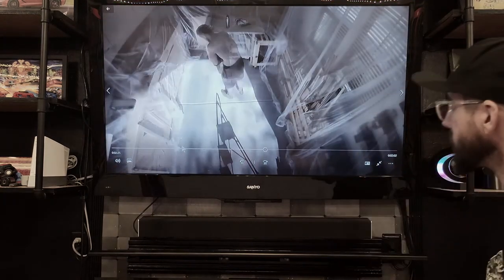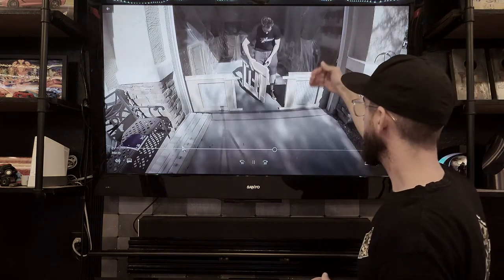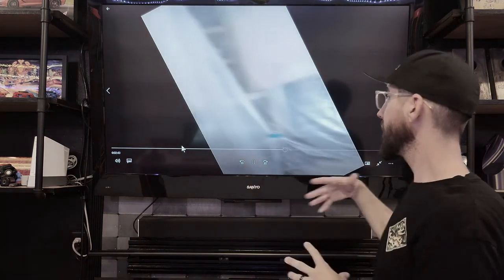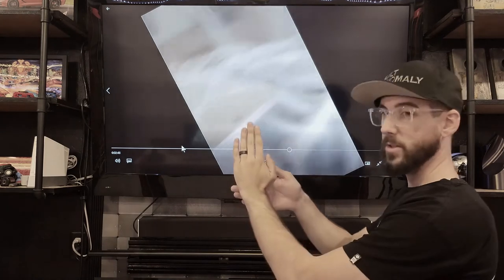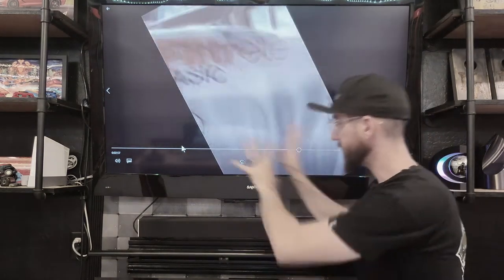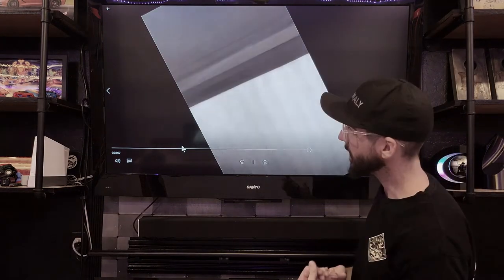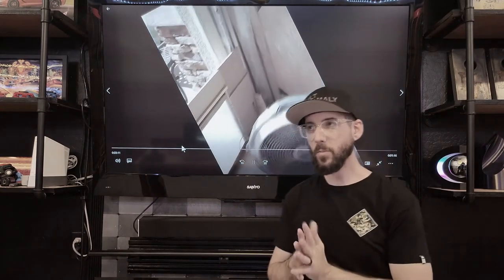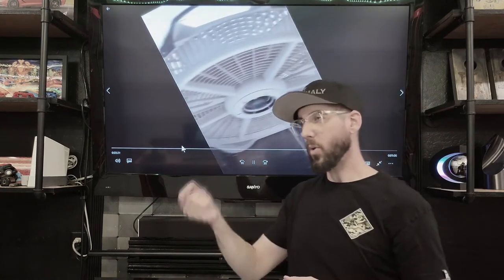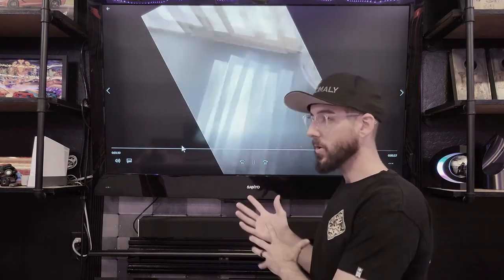I built a little unit where the garage door sits on top with removable filters, and ideally the fan comes in from the front outside so you're pulling nastiness away from you and the fan stays clean. I had a filtration fan on the inside and put another layer of filtration on the other side — dual layers — and that grabbed about 80% of the airborne particles. The rest would settle on the floor and build up enough to just sweep up. When you're painting outside, the risk is you get a great finish but then a bug or leaf lands on it and you have to pull it off and buff it. If you do it all inside behind a closed door, you don't have to worry about anything messing up your finish. An enclosed space like this is really useful.